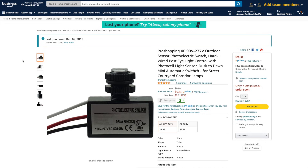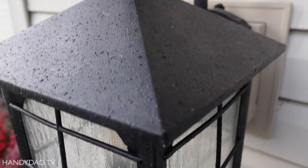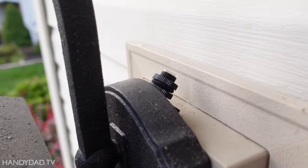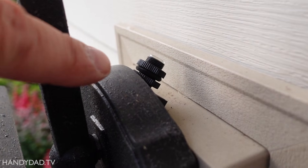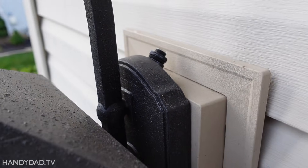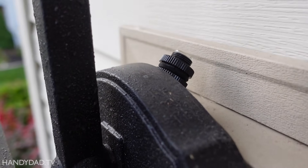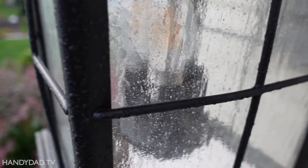Now if you've got two lights wired from the same switch and you really want them to go on and off at the exact same time, you can do that by adding a photoelectric switch — a little sensor that you put on the light fixture itself. To make it work on Julie's house, I have two regular light fixtures but I put a light sensor in back, wired in between the black wires. The hot comes into it and then feeds these two lights, and they go on automatically when it gets dark.